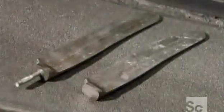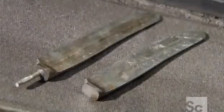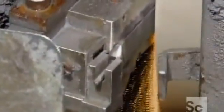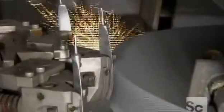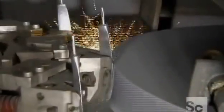After grinding the end of the bolster flat, the next machine welds on the tang, which fits inside the knife handle. Now, an automated grinding wheel tapers the blade thinner at the front. A second grinding wheel scallops the front edge. This is the knife serration. The thicker back end gives the blade strength to withstand the pressure you apply when cutting food.